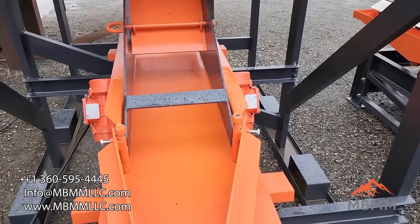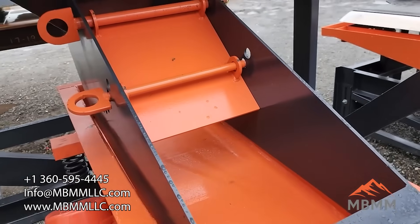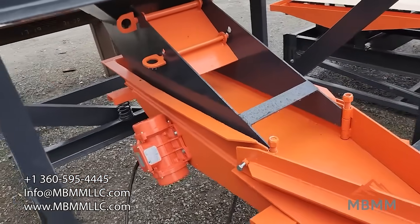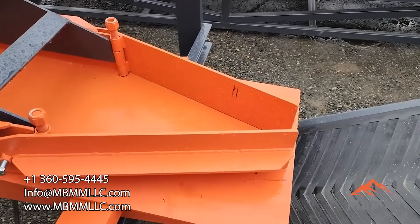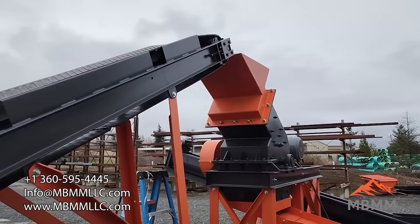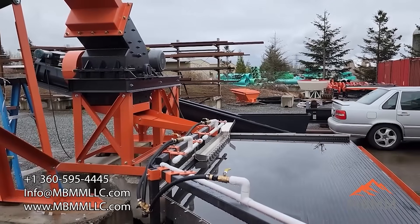Here's that vibrating tray — there are two vibrating motors on each side, and there are several adjustments you can make. One is this flap here, which you can adjust closed or open for a rough adjustment. There are also some adjustments on these wings for controlling how much material can flow out onto the conveyor belt. Both vibrating motors are run with a VFD so you can adjust how aggressively they vibrate — the more aggressive the shake, the faster the material flows through. This second conveyor feeds up into the hopper of the hammer mill, which likes a nice even uniform feed, and that crushes the material down onto the shaker table, which also wants a nice even slurry.